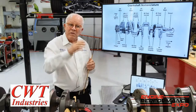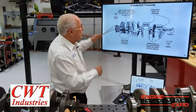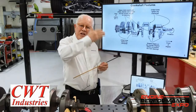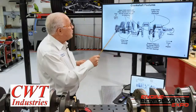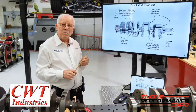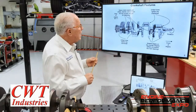On this particular crank, you see there are holes drilled from the back — that's strictly a weight reduction item. When you have a dry sump pan with different stages, this can deflate what you're trying to do. Putting the heavy metal in correctly is very important. I've seen people on the internet drilling in the end of the counterweight, and you do not ever want to take a chance of that thing flying out at 7,000 to 8,000 RPM.